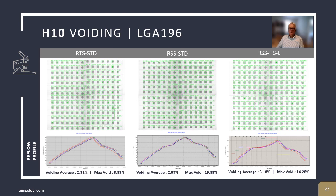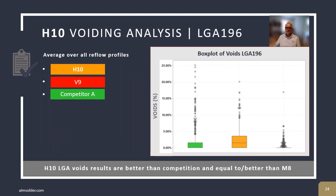Voids in solder joints are a common evaluation point for solder paste. In this case, we're looking at a land grid array, an LGA, which is considered one of the more challenging components as it relates to voiding. In an LGA, solder paste comprises the entire solder joint, and as solder paste is approximately 50% flux by volume, evacuating the gases during reflow is critical. H10 has excellent performance on LGA as it relates to voiding in all profile styles. Comparing H10 to V9, AIM's low-voiding no-clean solder paste, against competitor A: while V9 exhibited the lowest voiding overall, H10 was a close second and our competitor a distant third.